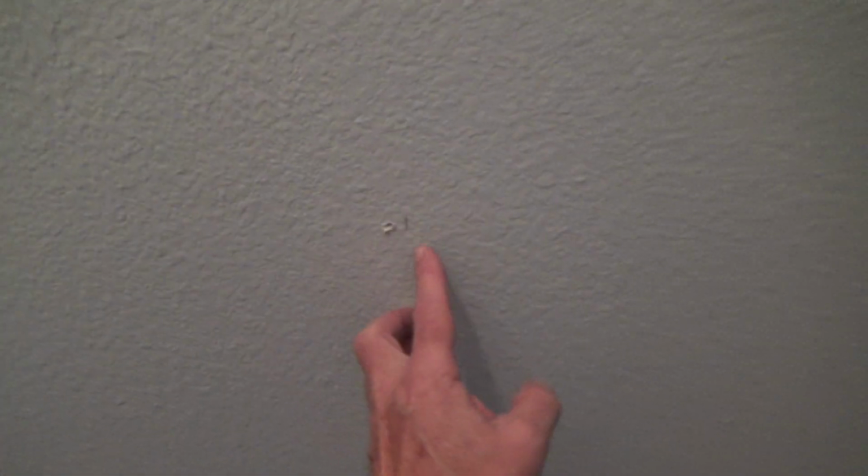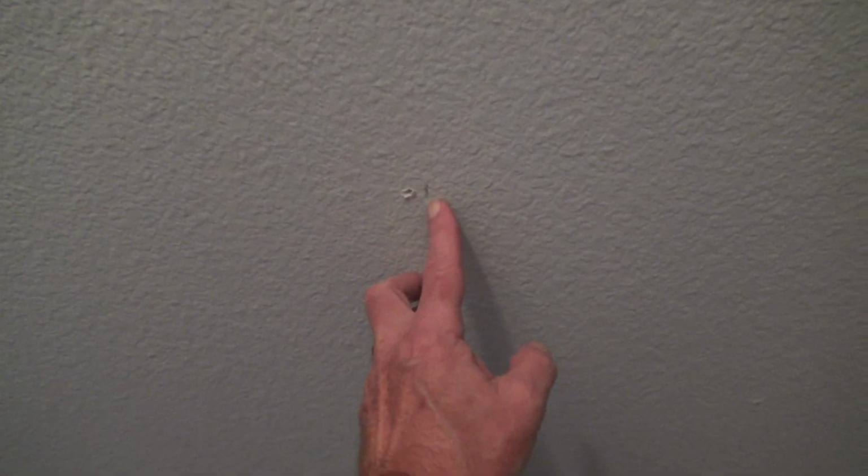Because see where the center of this line is, where I found the center of the studs, I've got to transfer that down to the bottom of this, and I don't want to mark down too low. That's why I'll get my level, line that up, measure up, get a mark at the bottom. Do you see what I mean? Okay, that's my next step, figuring that out. I'm going to make it either 22 inches off the floor or 21 7/8 all the way across.